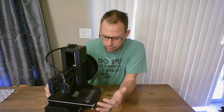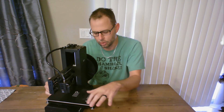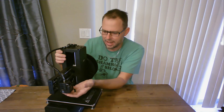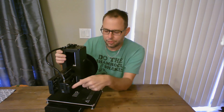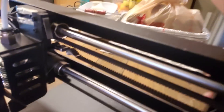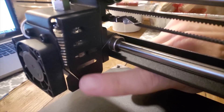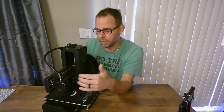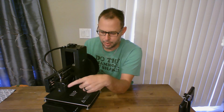It's a good printer, but it only prints PLA — there's no heated bed. It does need a glue stick on the bed. It looks like a build tack type of surface, however when I tried to print on it with no glue it really didn't stick very well, so you need to use the glue stick. I've got glue stick all on here now and it's printing very well. It has what appears to be an E3D V6 style hot end. One fan — only one fan. The fan has a divider that divides the air partway to blow across the cooling fins and part of it to blow down on your part. It is on all the time. You don't have a dedicated part cooling fan that you can leave off for the first layer or gradually ramp up — it is on all the time.